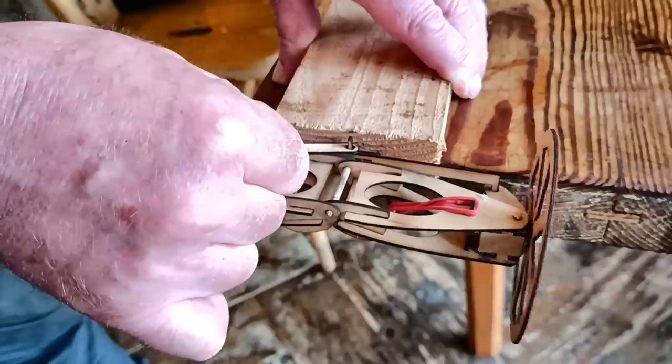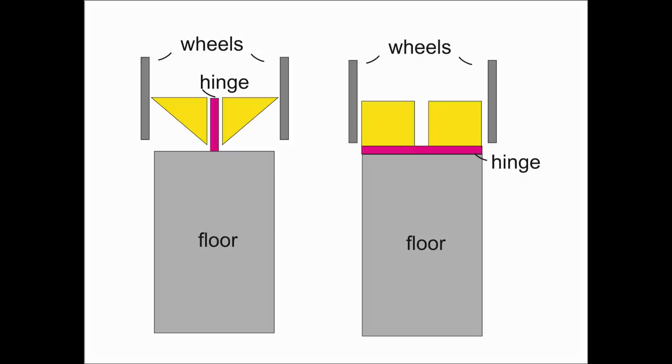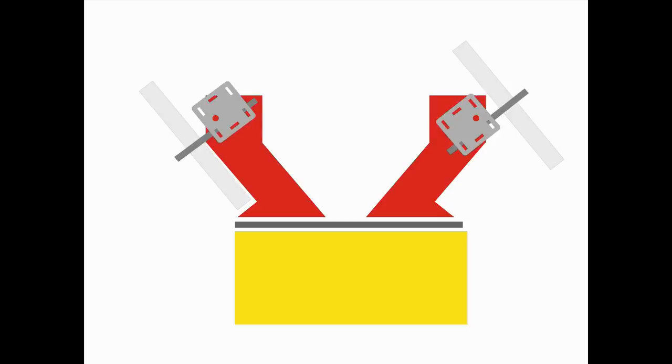In fact, because of this very problem, I did consider changing the suspension arms so that instead of pivoting laterally across the car, they pivot longitudinally. That way the distance between them doesn't change much at all. But there are obvious complications because they'd need big cut-outs to allow the wheels to steer. So I've parked that till we can test the first version.